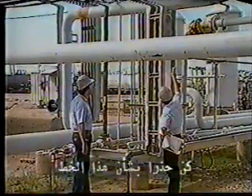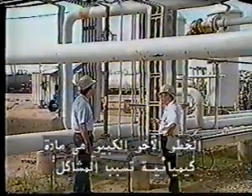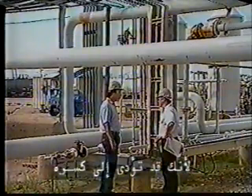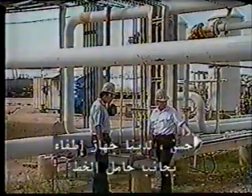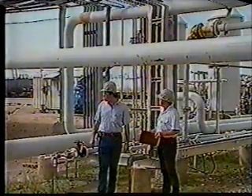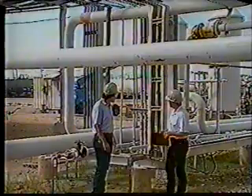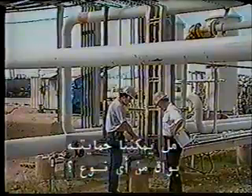Now be careful around this line up here — it's carrying superheated steam and it'll burn you if you make contact. The other major hazard is a corrosive chemical that runs through this PVC line. Be careful not to drop any tools or pipe on this line because you can break it open. We'll keep our stuff off those lines, believe me. Now, we keep a fire extinguisher next to this pipe support, and there's a safety shower and eyewash station over here. Your people also need to carry an emergency escape respirator when they work out here. I'll make sure of it. Any questions? Yeah — what does the PVC line carry? Would it be all right for us to protect it with a shield of some type?